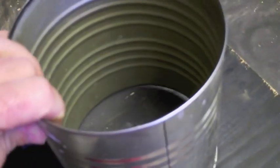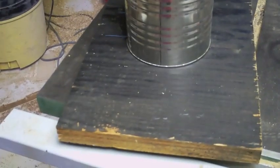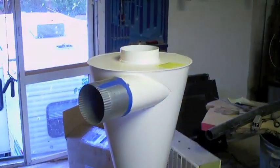This is going to be the bottom attachment point for the dust collector itself, so this is spaced up the proper amount. I'm going to use this coffee can here as the actual outlet spout. My six inch hose will clamp on here, and obviously it's upside down. But I'm using this board here — it's handy. That is the proper offset from my backer board. This will then locate the bottom spout, lock the whole thing in securely, and then I'll build something for the top spout. So what I need to do now is double check these measurements, cut this to size, and get ready to bore a rather large six inch hole.